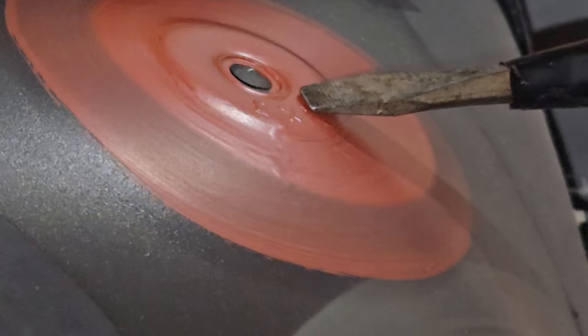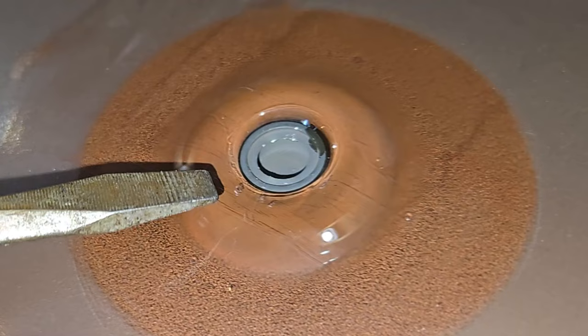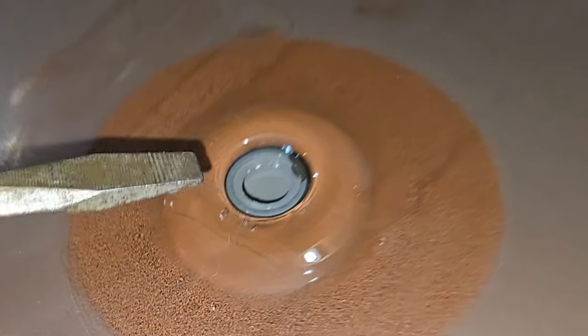All right, so there were actually three of these Toshibas in my shop, and I worked on all three of them. And when I went to discharge them, funny enough, I couldn't get any of them to actually discharge when I was setting up the film. They just didn't have any spark in them. But when I did live streams and worked on the two Toshibas on the live streams, these AFs, they both zapped that time. And these are Orion tubes. So I would always be careful and expect there to be a zap on these Toshibas, even though I didn't get one this time.